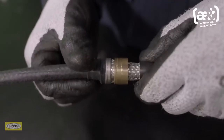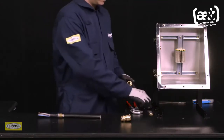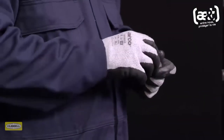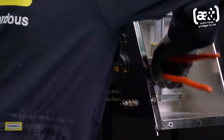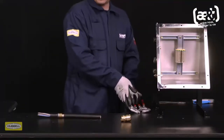If it isn't satisfactory, repeat the previous steps. If required, fit the appropriate IP washer onto the entry thread. Fit the entry into the enclosure and use a wrench to tighten, then add a quarter turn. Depending on the enclosure used, the method of installation will vary.